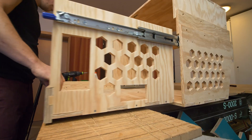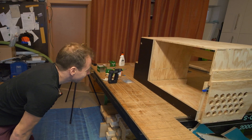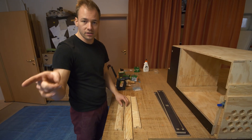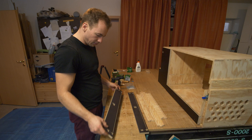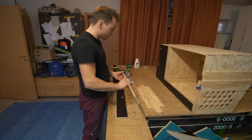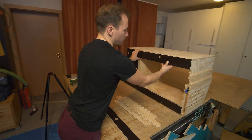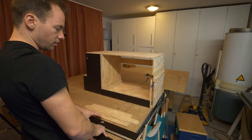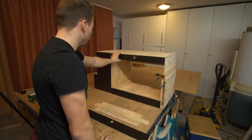Well, this is not what I want this to be. But there is one drawer left to check. These are the parts for the top drawer — the bottom is still missing. I'll cut this on my circular saw as it's just a simple rectangular piece. As I mentioned in the last video, we have two different front pieces: one high and one low. We have different sizes of fridges that fit in here, so we can mount the drawer a little lower for more volume inside the drawer but a smaller fridge underneath, or two centimeters higher for a smaller drawer but more fridge space.